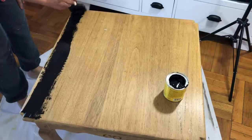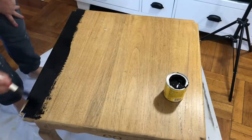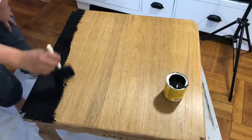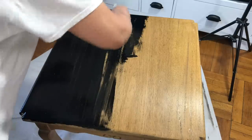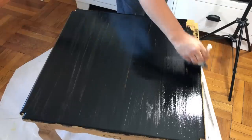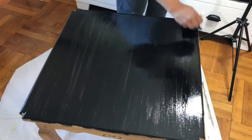When I paint, I just try to give it a very thin coat, trying not to keep going over the same spot over and over again. You just want to keep moving across the table. You are going to see some wood peeking through because the first layer is going to be a very thin layer, but no worries — you're going to come back.